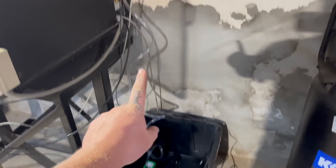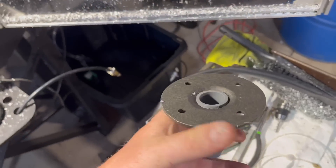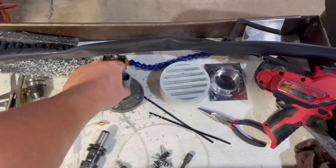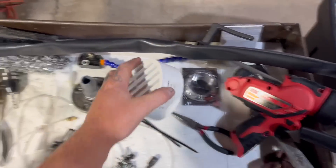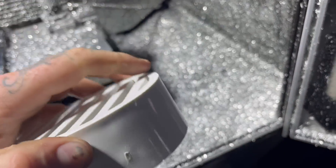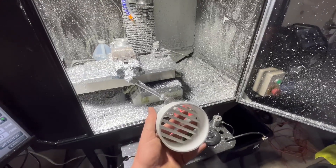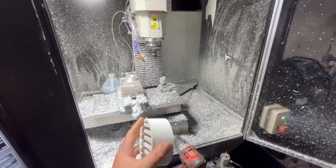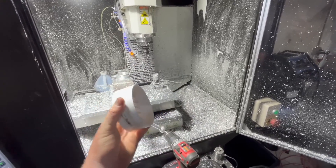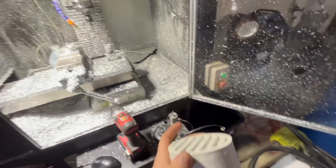I've got my pump set up, got our line run up and over, zip tied. I've got a hole drilled and a flange — I'm going to goop the bottom of this flange and stick it up there. Then I've got some drain line, and I'm going to drill a bunch of holes in the side and glue it on so it can keep chips from polluting our coolant. This is probably all very crude and you'll tell me a hundred ways I'm doing it wrong, but I just want to see how well this works to get us by until I can afford or find a used coolant setup.